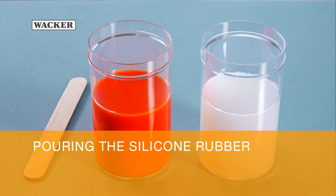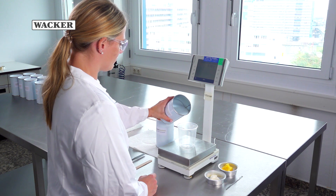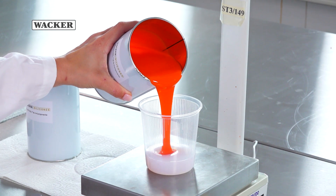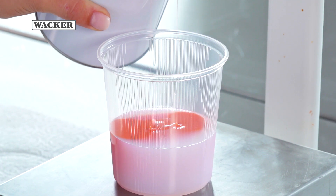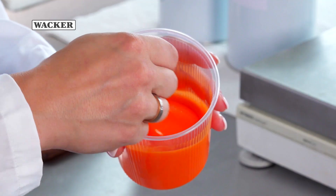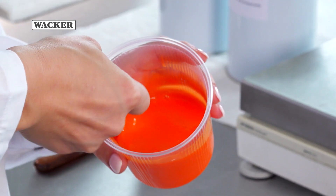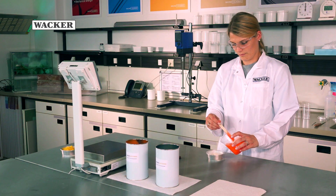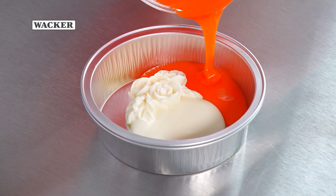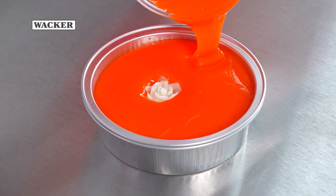Pouring in the silicone rubber. To make the silicone mould, a two-part silicone — in this case Elasticeal M, A and B — is mixed in a one-to-one ratio. Use a small spatula to blend the silicone compound manually. In order to prevent air bubbles from forming, do not stir the compound too vigorously. You can now pour the homogeneous mixture into the prepared mould container. Pouring the mixture in from the side will prevent air bubbles on the mould surface. The master must be completely covered by the silicone mixture.